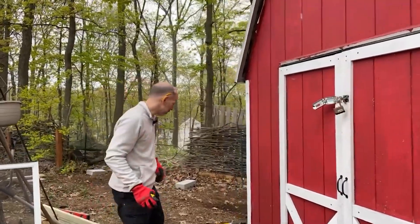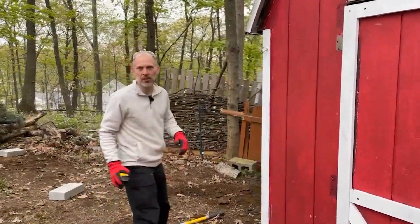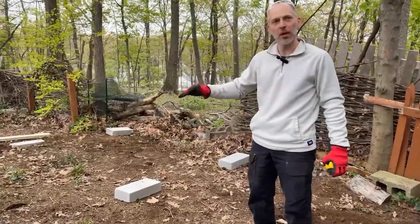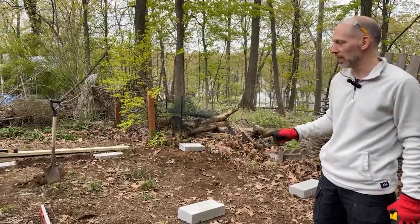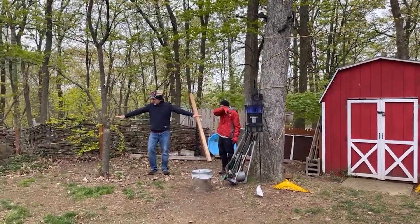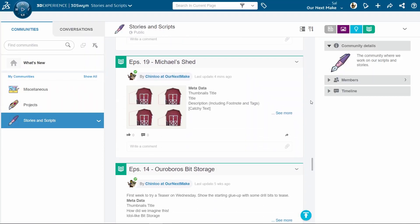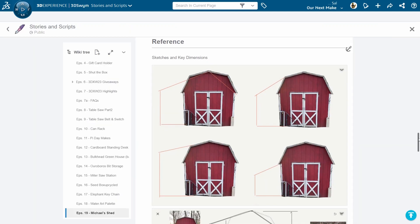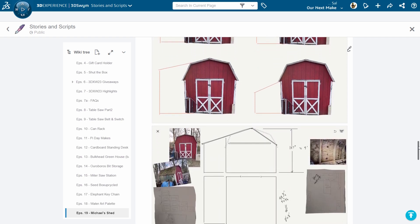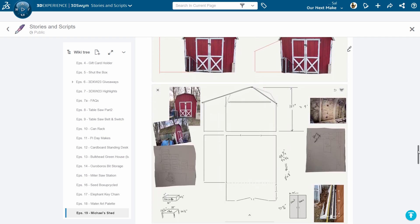Right now what we're doing is setting up to establish the footers of the new location. We've laid out some pavers in rough locations, and now we're going through and leveling each spot individually. The goal here is to transform an existing 8x8 shed into an 8x10 office with additional storage on the side. Before starting on the project, Sal's brother Michael texted us a few photos of the shed, and I started sketching out different roof options. I added all of this information to our private wiki we created for this project, so Sal and I could keep track of our progress.